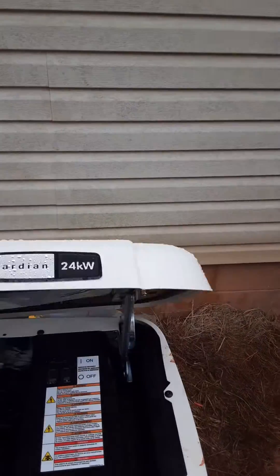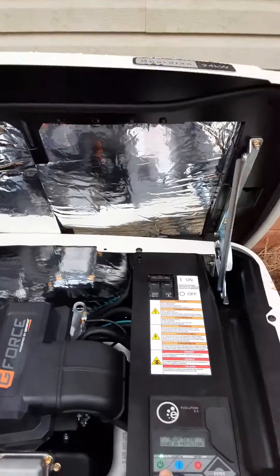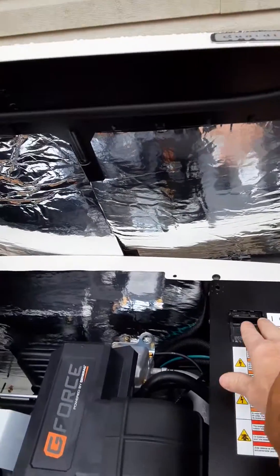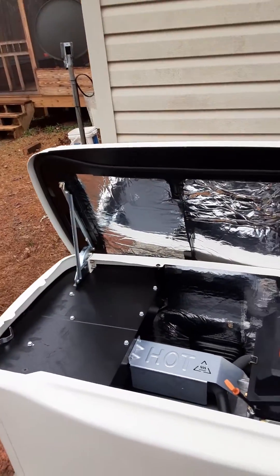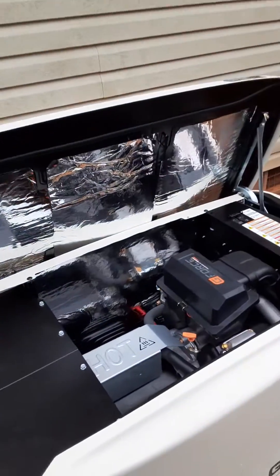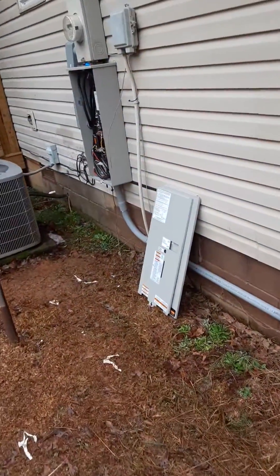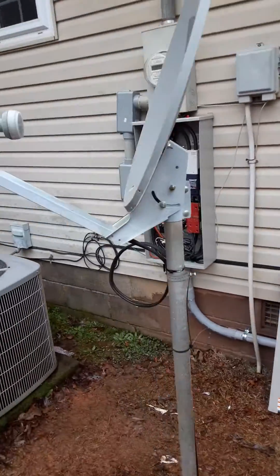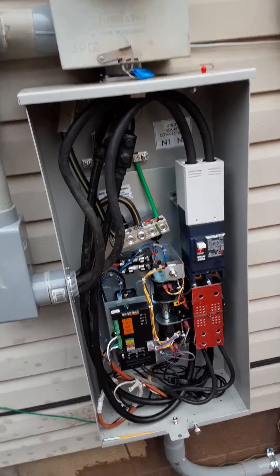After a couple days of installing it, it came time to run the generator. I come to the auto switch, would hit auto if the main breaker here was on. It would, although you had utility power, for some reason the generator would automatically crank. It would send power to the transfer switch, dropping the transfer switch from pole power to generator power.